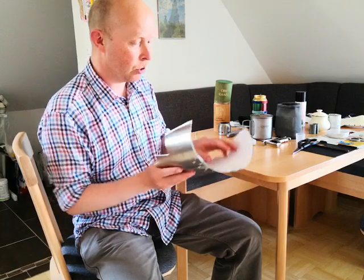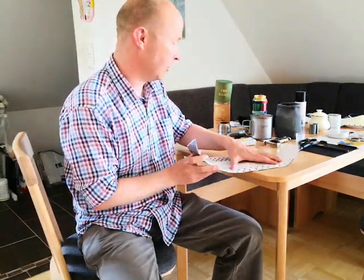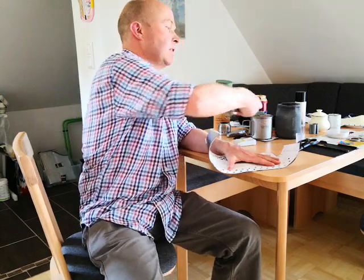Then it comes time to punching your holes, and there was a good reason why we put our pattern on the inside. It's because we're going to use this. It is a McGill 303 heavy duty paper punch. This had to be ordered from America, just like the titanium foil, not available in Europe. Maybe there's a European alternative, I don't know. I would recommend a heavy duty paper punch and not a metal punch.